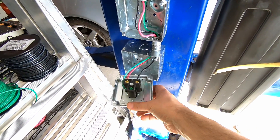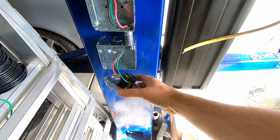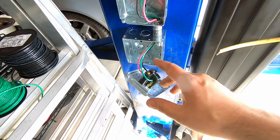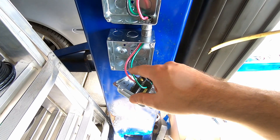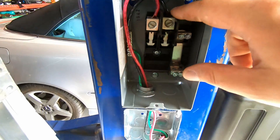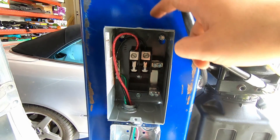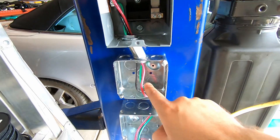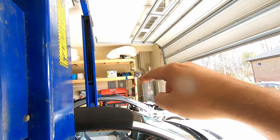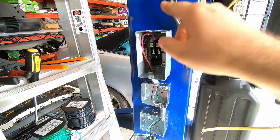I managed to wire the 240-volt outlet here on the lift, running it to the panel. There are two hot leads — black and red — and a ground lead, the green one. There is no neutral wire for this 240 setup. Those wires are simply passing the 120-volt future outlet and I connected them where the 240 power comes inside the box — they are before the breakers, because those two breakers are only meant for the 120 outlet. The breaker for the 240 outlet is going to be in the box on the wall. I'm just trying to mock up the wiring in this area first.